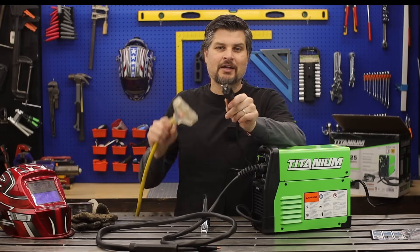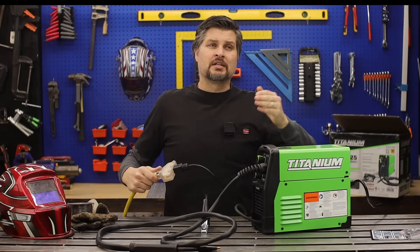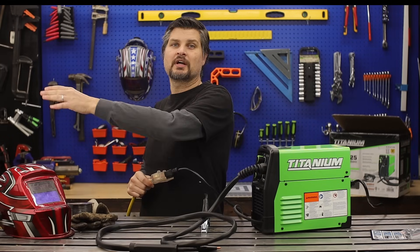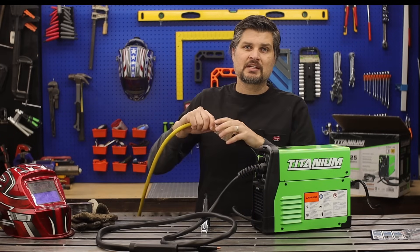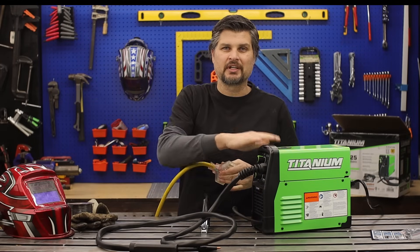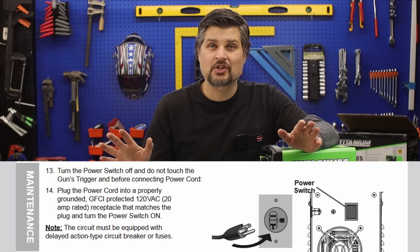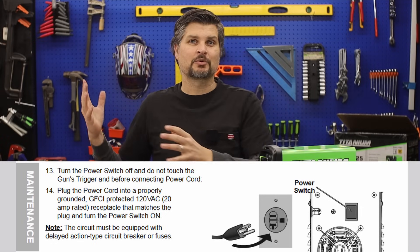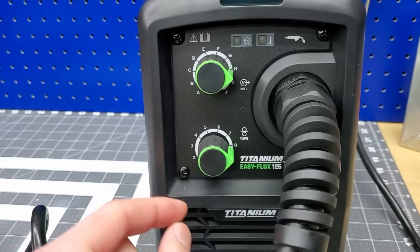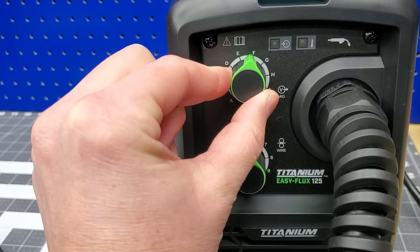I pick up 0.030 size wire — it gets me through all my projects. The machine has a regular 120-volt plug so you can plug it into any house outlet, but you should do it in your garage with the door open, or outside. If you use an extension cord, make sure it's a thicker one — no 16-gauge, that won't run the machine. I use 10-gauge and it runs great. The question I get asked all the time: do you really need a 20-amp breaker? Yes, if you're going to be at the max settings. If not, keep the settings at the middle or below and you can run it on a 15-amp breaker.